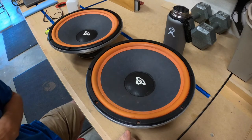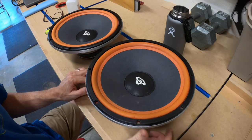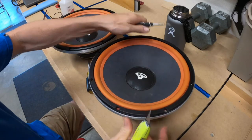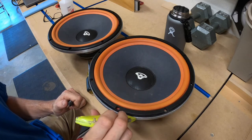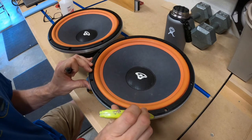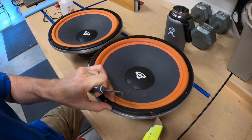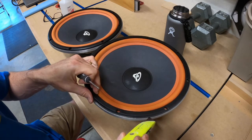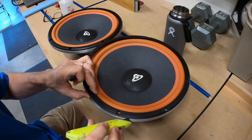I have a kit I bought off eBay. The kit contains two 12-inch rubber surrounds — these are 12-inch subwoofers from Cerwin-Vega, out of the VS-120 speakers. I'll use my utility knife, just put the blade down inside and pry up. This doesn't take a lot of room; it's a good tool for the job. If you listen carefully you'll hear the adhesive start to give up.